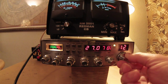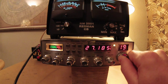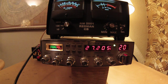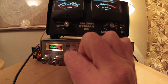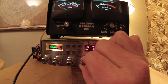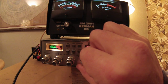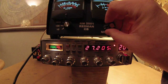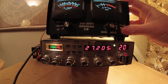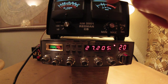Now we'll go up to channel 20 here. On the bayou — I don't know quite where the bayou is, but it's booming in here loud and clear, somewhere back east. Channel 20, let's calibrate it. There's our SWR reading, it's pretty low. Now let's go upstairs here to this meter — calibrate it. And again, it's very, very low. It's a little bit higher than before.